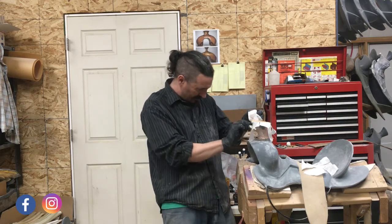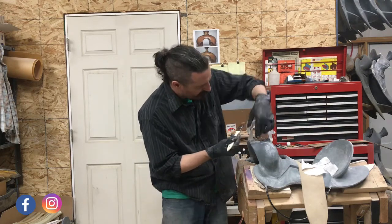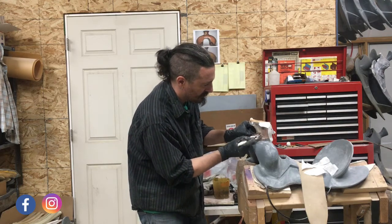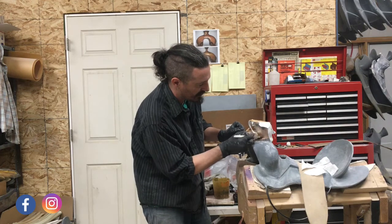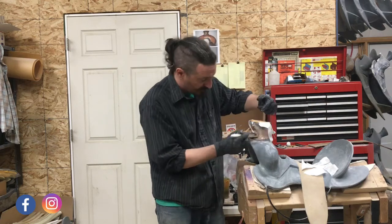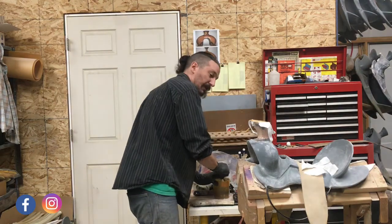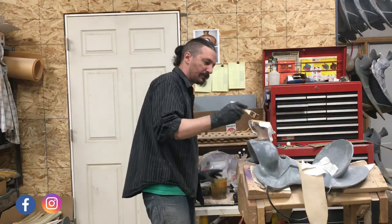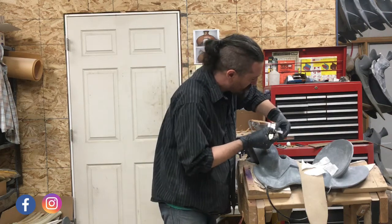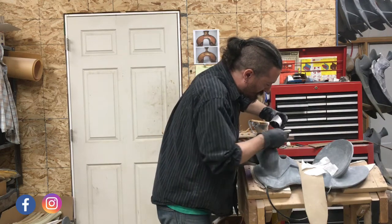The great thing about this single weave fiberglass is that if it's not going in the direction you want it to, if you cut those tabs, you can see how that one's laying down in almost a straight line. And if I need to, you know, bring a tab around or make it where it's not catching, you can make sure that all the little tabs and all the little surfaces get covered by the tabs. I go clockwise or counterclockwise, but find a direction and go with it.